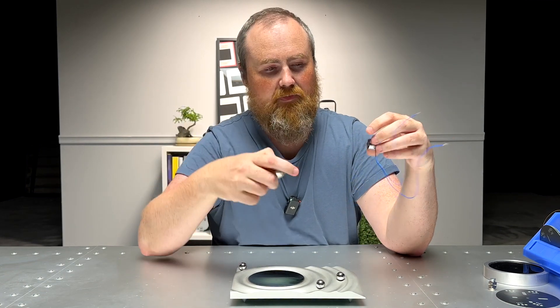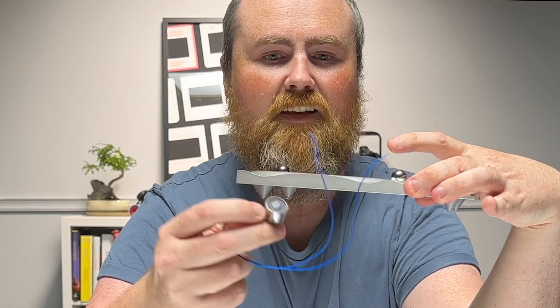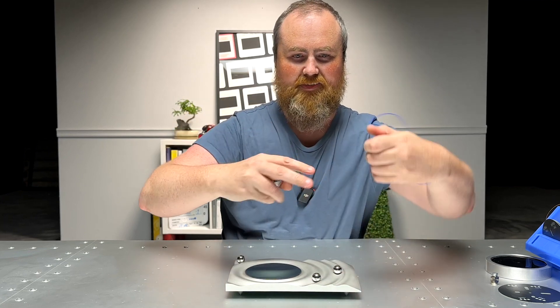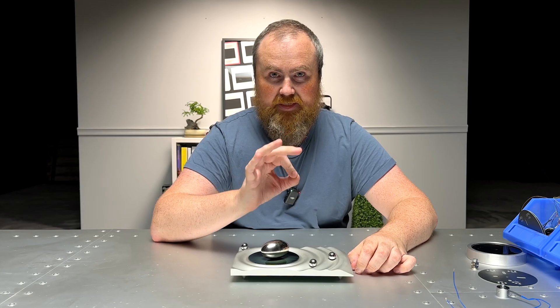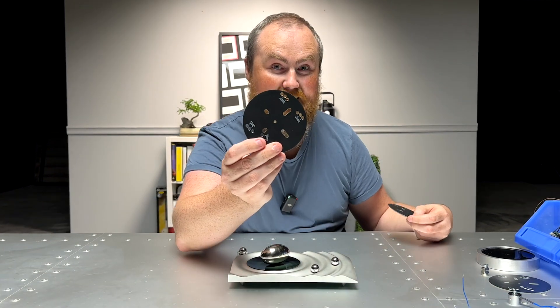It's also very thick. If it spins on the table with a huge thing underneath, that's not impressive. We wanted it as thin as possible. So we need to make our own electromagnet — thin and easy to manufacture. What we came up with was PCB coils.